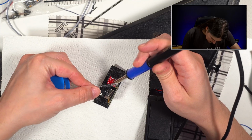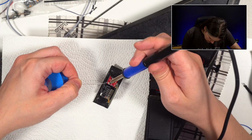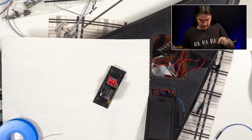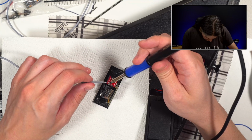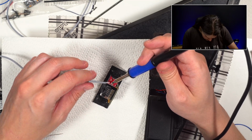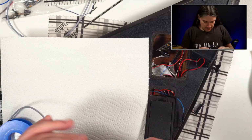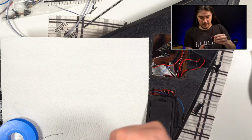And finally, I wired the extra switch, which is right next to the output board. It will be used to connect the normal output of the guitar, which means magnetic pickups and everything that comes with them, to the Hexpander. So when it's off, it is not connected, but when it's on, the sound of the guitar goes to the Hexpander and to the unit it is connected to, a guitar synth for example.